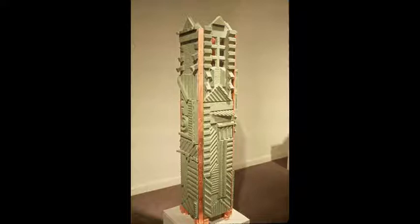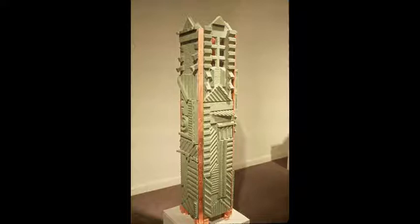Properly used, de-vit can work for an artist, like in this container glass piece fired in a plaster silica mold by Jerry Newcomb. But generally speaking, people want glass to look glassy. When I make a complex mold, like this piece by Rachel Gaspers, I want the mold to give me a consistent quality of relief and a consistent gloss until the mold fails, not just until the relief details build up with mold release.